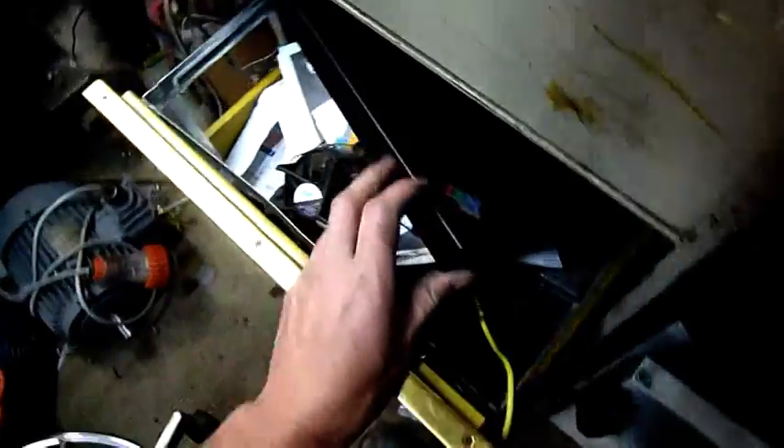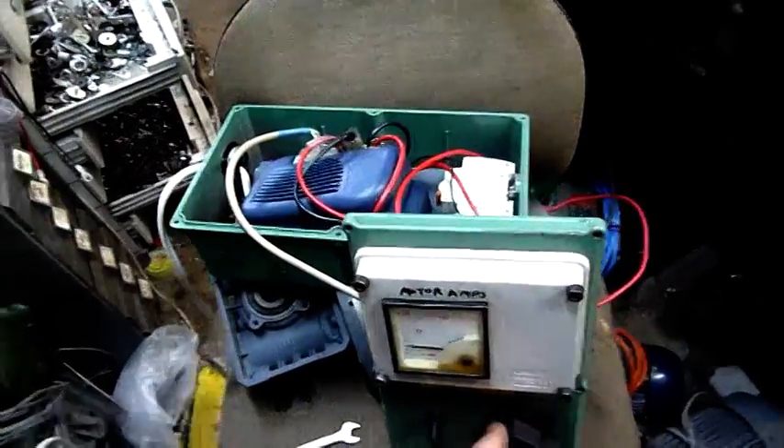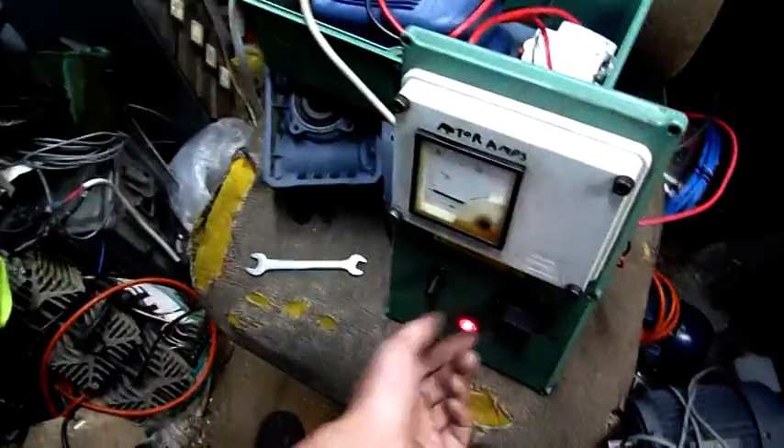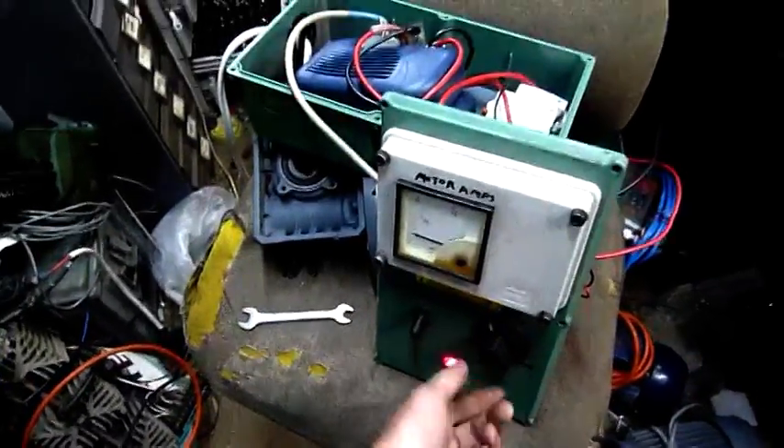I think I've got another swimmer in the cupboard here somewhere. It's either on or off — it doesn't let me vary the speed with the potentiometer, it just runs flat out or not at all. There's something horribly wrong with it. The whole board was oxidized and nasty. I did a bit of rebuild work on it and the best I got was virtually no speed control — it'd start moving at the bottom and by full throttle it was going flat chat.